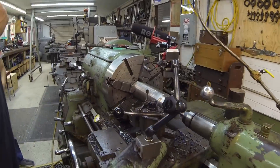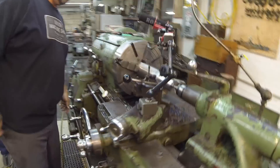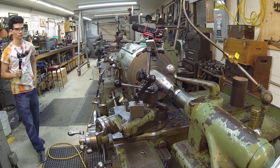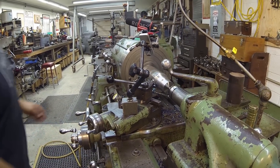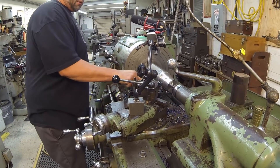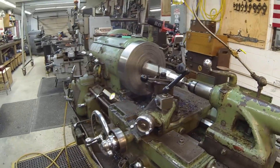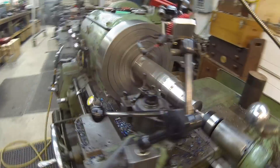Adam is setting up to do the last journal and we are half an inch over on size, so he's going to take two quarter-inch cuts off of this thing. Let me make an adjustment on my feed rate — it's not chipping off the way you want. Let's see if I can speed the feed rate up. There we go — you can see that chipping.